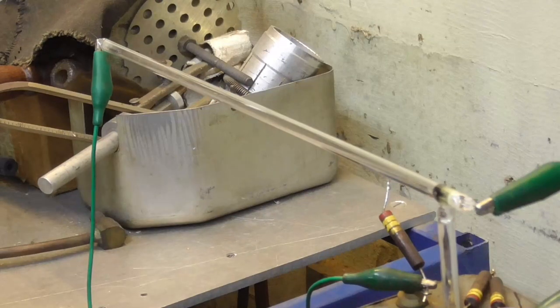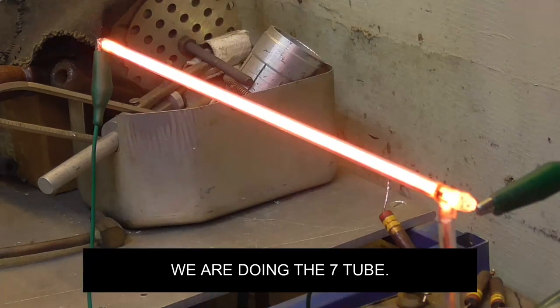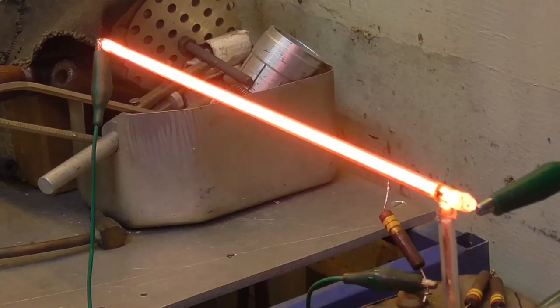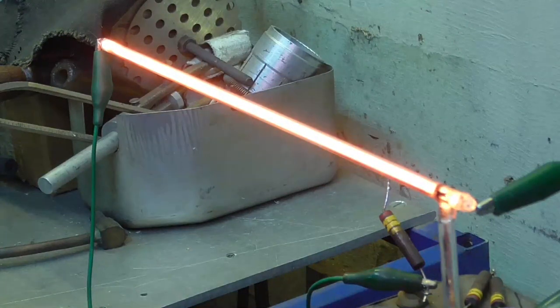Okay, we're in the 20 micron range. Okay, I'm going to close the vacuum valve, open neon. Okay, there we are, 1.16, that's 1, 2, we're going to put 5 torr, that's 3, 4, gorgeous, gorgeous, gorgeous. Okay, that's just a beautiful, solid color, we don't have any purple showing up at all, so we're hermetic.